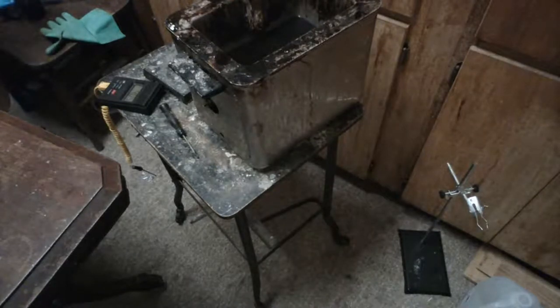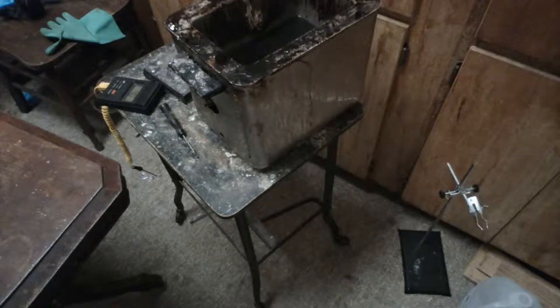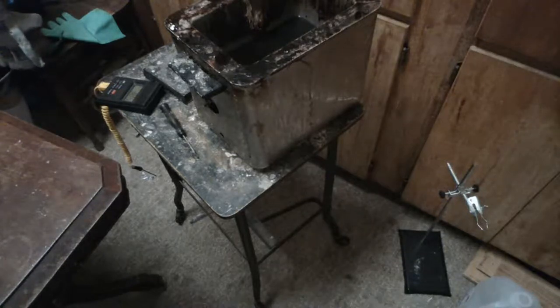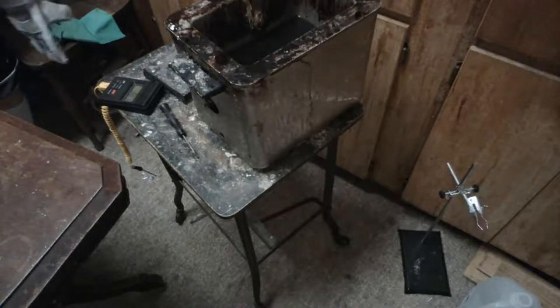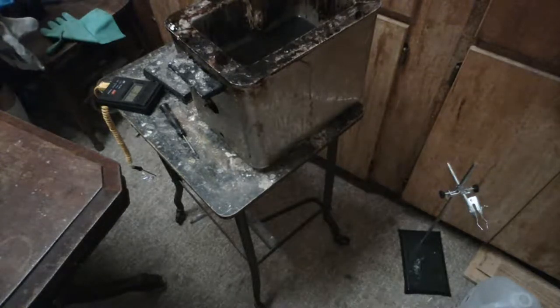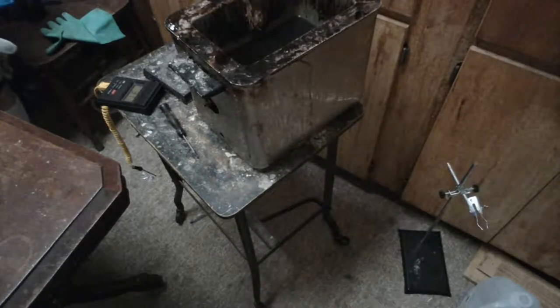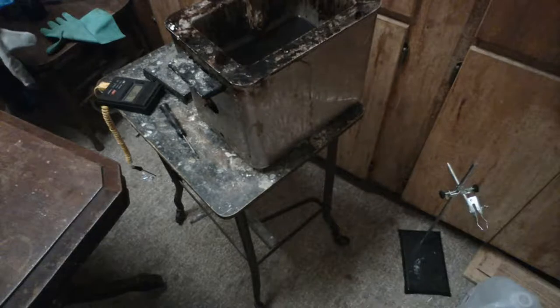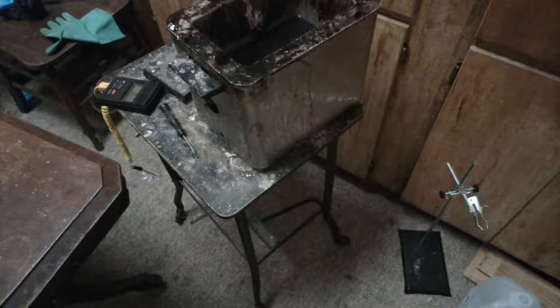That was the commercial process of making the brown wax records from 1889 up to whenever they stopped making brown wax. It's probably somewhere in the 1910s, because they sold brown wax recording blanks for quite a while. If any of you have an exact date, I've looked and never found one. I've seen 1912 on some of the black wax blank boxes, and the black wax four-minute boxes. Some of the records have ribbed bores, and some have spiral bores. And some have writing on them, and some do not.